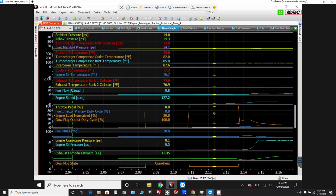But this part here where it's just cranking and running the glow plugs, where it probably doesn't need to given the current temperatures, I'm just going to turn that off for the next start, and we'll see how that plays out. So look for that on the next video, and we'll see what a difference that makes in terms of how quickly the engine starts. And that's how I used to have it before I had the glow plugs working. So again, we'll see how it plays out.